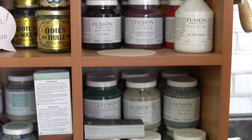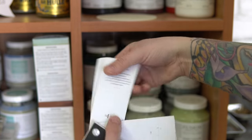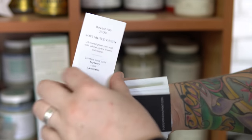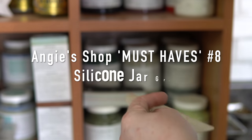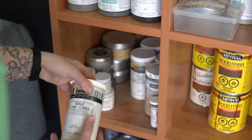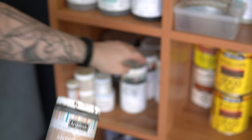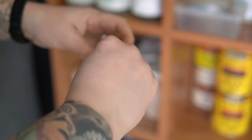This is a really great thing to have if you use Fusion Mineral Paint — it's a fan deck of all the colors they make. What's really cool is at the end there are these colors, and if you like a particular one and flip it over, it's actually a recipe so you can make custom mixed colors. Unlike some other fan decks, it's actually quite accurate with the color. These little silicone grips are great for opening lids that are a little stiff from dried paint. Lead test swabs are a must in any furniture workshop — you just never know, and it's better to be safe. These are really easy to use — you basically dip them in vinegar, rub it on the surface, and then check for a color change.